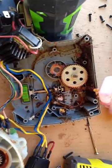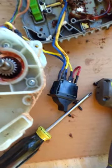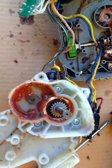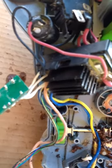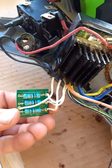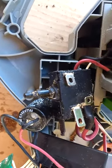You can see the reduction here — a lot of sawdust collected on the inside. That's the kickback switch. Here's the motor, and it actually routes the oil directly into the motor casing, which was a bit of a surprise. There's the controller, which is completely potted — pretty cool, but definitely not easily replaceable. There's a set of resistors, a large capacitor which seems fine, and then there's the main switch, which is pretty heavy duty.